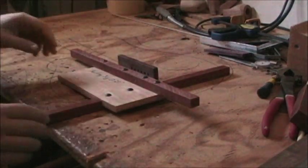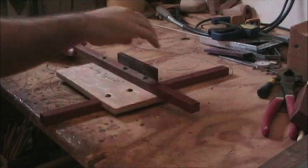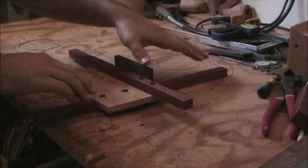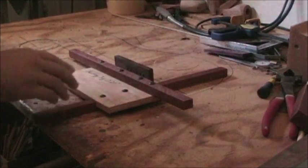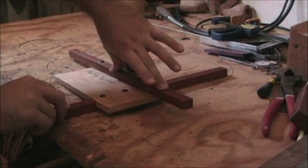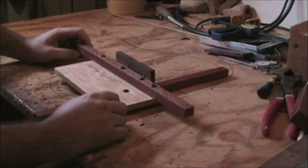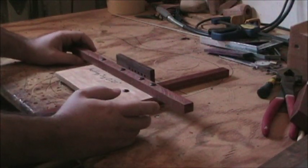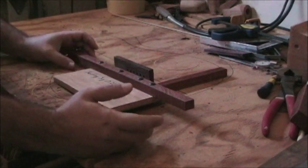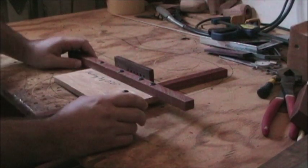The next step is to take a little cross member and make it pretty long because it is going to have to support the big long kerfing strip as it runs through. Put this on and make sure that it is at an absolute 90 degree angle to the slider, because that is how we are going to get absolutely straight cuts in the kerfing blank. This piece was only designed to run one piece of kerfing through, and that got old pretty fast because you are doing 70-80 cuts on these things. I only do 20 inch or so pieces, so there can be a lot more cuts than that.